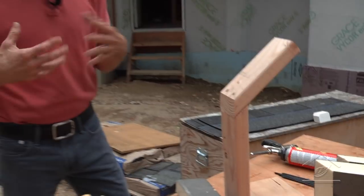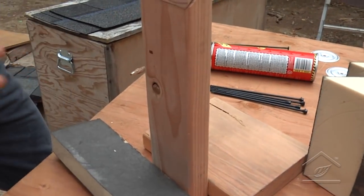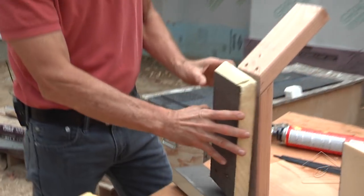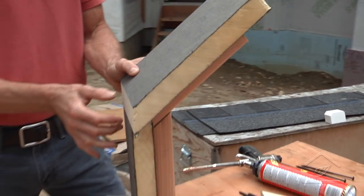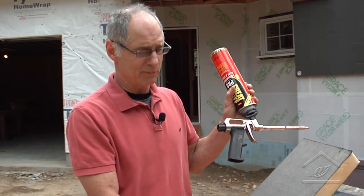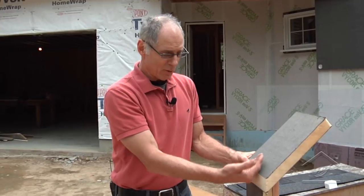I'll do a quick representation of what we're doing. Imagine this being the outside wall and this being the roof going up at a 10-12 pitch — about a 40-degree angle. Not only do we stagger joints across the wall, we also stagger where the wall meets the roof. Say we put the inch-and-a-half insulation on the front of the wall; we do the same on the roof and that layer overlaps the joint. Every layer of insulation we apply, we put spray foam in between to really seal that joint.